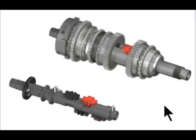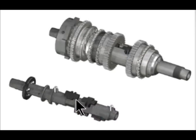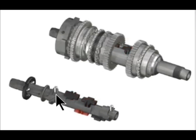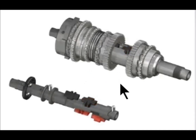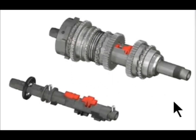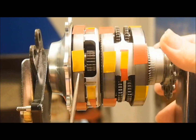Gears 8 through 14 are a repeat of gears 1 through 7 without the reduction at the output. Through the first seven gears, the shifting shaft has made one complete revolution. As the shifting shaft begins the second revolution in the shift from seventh to eighth, the pin that actuates number 3 clutch is guided to a parallel groove. This allows the clutch spring to engage the clutch to couple the low range sun gear to the output planet carrier, driving it in a 1 to 1 ratio. At the same time, clutch 4 is released to allow ring gear 3 to rotate as a unit with the output planet carrier. With the sun, planetary and ring gear locked together, the gear reduction unit is deactivated.